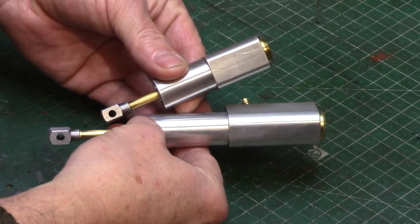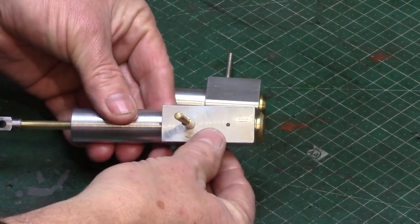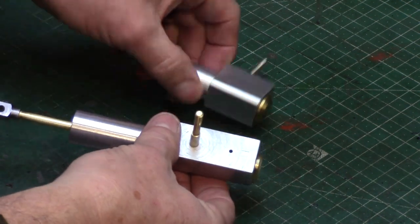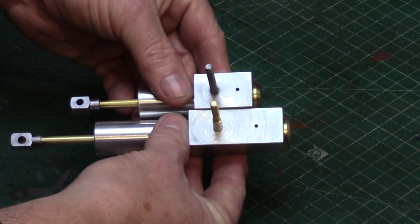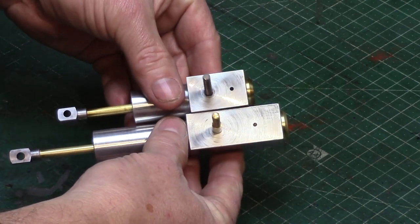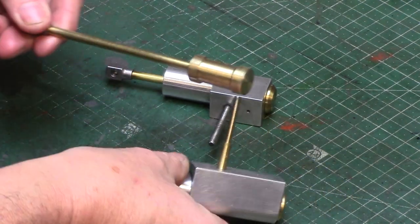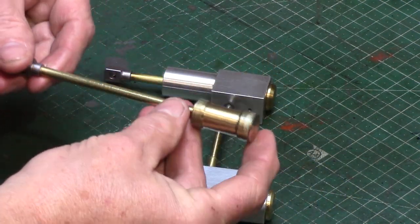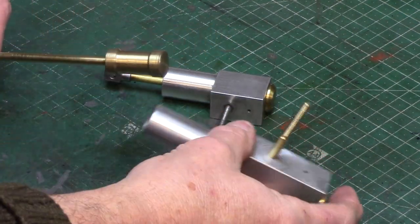The new cylinder length is 100mm long but retains the other original dimensions of the Wigwag design. The piston has been extended to 30mm, and the pivot point is now set at an extended distance of 140mm from the axle. The ports are set out on a 20mm radius from the pivot, which is 8mm further than the original plans.